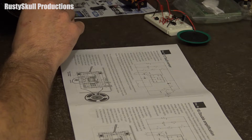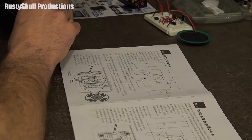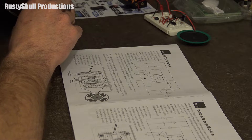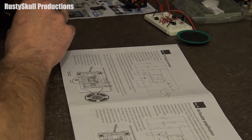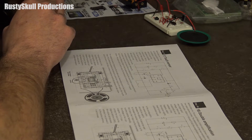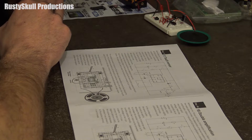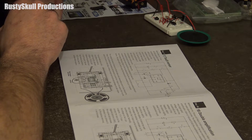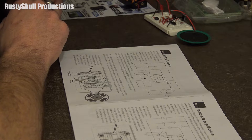You will find a part with three connections — a transistor, which is a part that strengthens and amplifies small currents. This is a BC557C PNP transistor; the C stands for a large current amplification of 400 times or more. A touch sensor switch can be constructed using this transistor. Remove the insulation from two wires and add them as indicated to create the touch sensor.